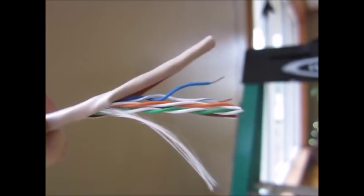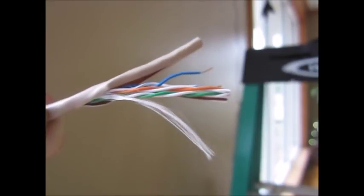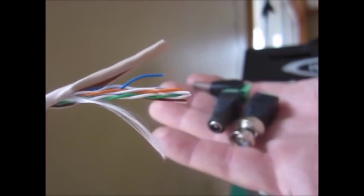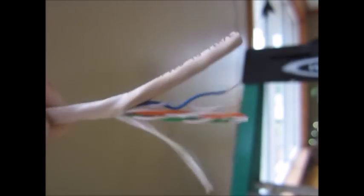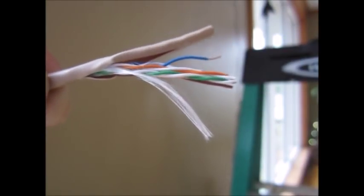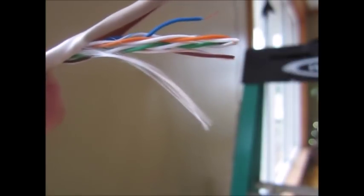What I like to do when I'm installing these surveillance systems, the analog ones anyway, is use Cat5 with these Keen baluns instead of pulling through the wires that come with the camera. Cat5, it's so slim and thin, and you can coax it in different places where the other wires cannot go. And that really helped me out today.